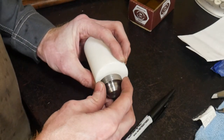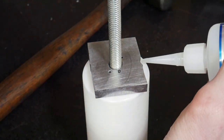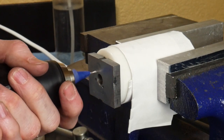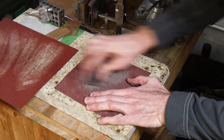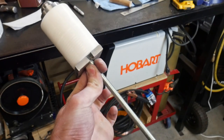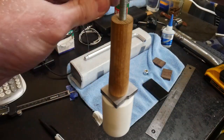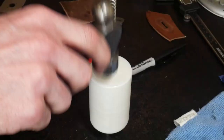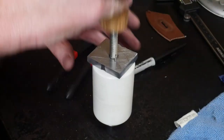You can see how the two pieces fit together once we have the locator pins lined up and drilled. Next we use the drill guide in the position it will eventually end up in — the spacer between the nylon and the wood — to drill some holes into the nylon, then break the two apart. This is the type of residue generally left behind during each one of these iterations; to clean it up I just take it over to some 120-grit sandpaper on a granite surface plate. We then do the same thing on the wood side, gluing the wood handle to the spacer and passing the holes through. A mini test fit with hardened dowel pins in the nylon, then the spacer, then the wood handle confirms things are coming together nicely.